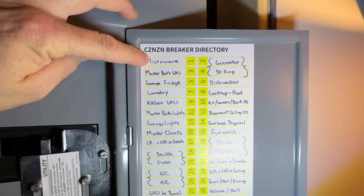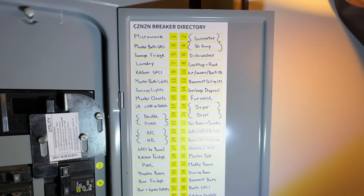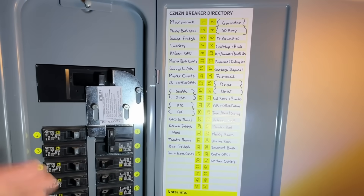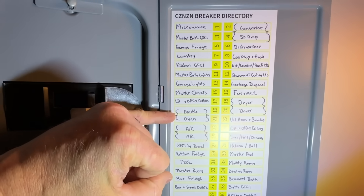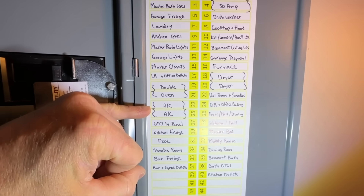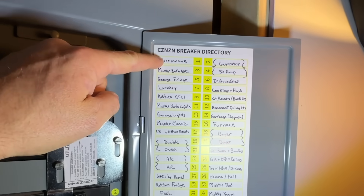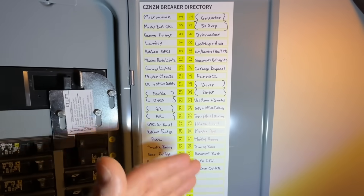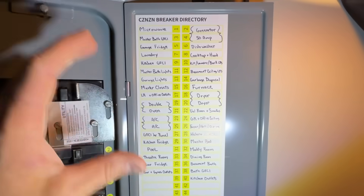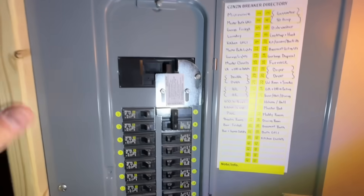You can still run the microwave — you just have to know what's drawing current in your house and do the math accordingly. If my generator were a little more powerful it might run everything, but to be safe I turn off my double wall oven, outside AC, and dryer. I could run the microwave if I turned off lights or breakers to maybe the second floor. That's why this is considered a manual generator service.